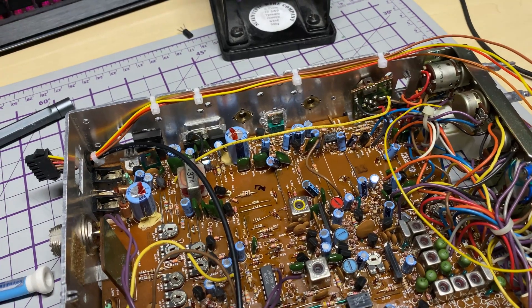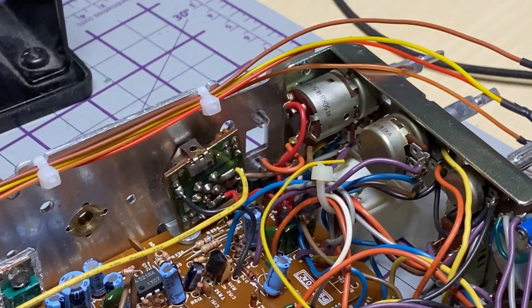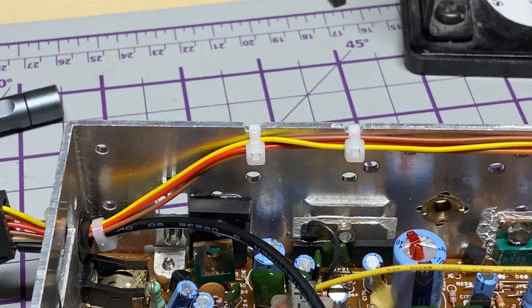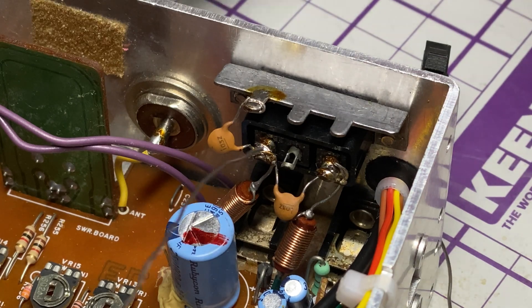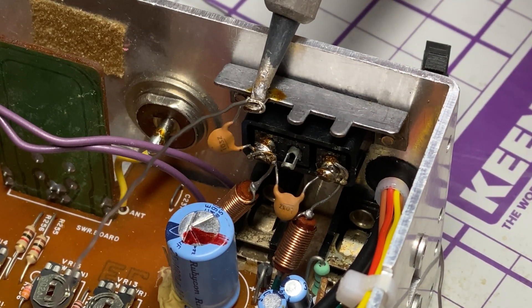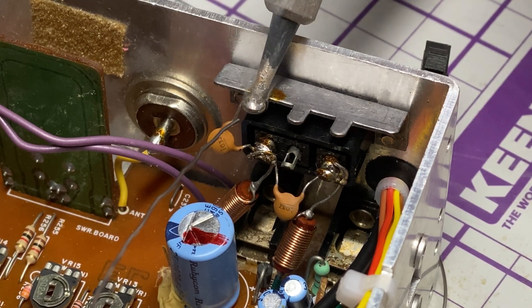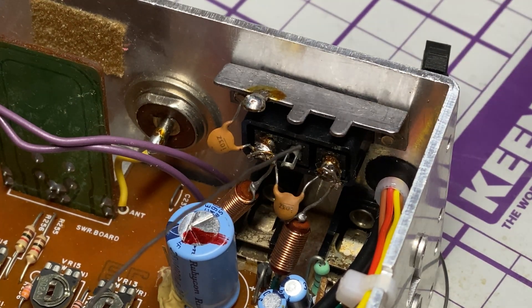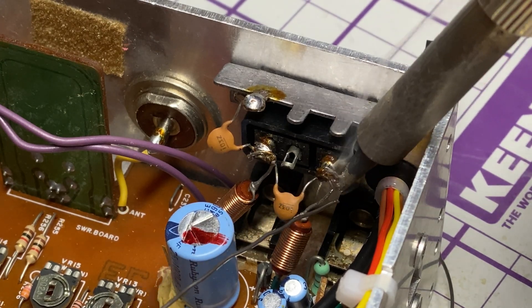The 2SA1012 goes into the place of the other transistor we removed, just turned around, which should provide an upgrade for that circuit. Here's the frequency counter loom — we've got a coax that needs to connect to the VCO, and also power, USB and LSB. We're routing it around the side nice and neatly, using the cutouts which seem to be conveniently placed for the cable ties. We pop the power socket back in and solder up all the connections. I took the power socket out — that charged capacitor made a nice spark!